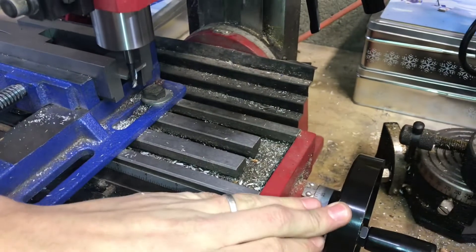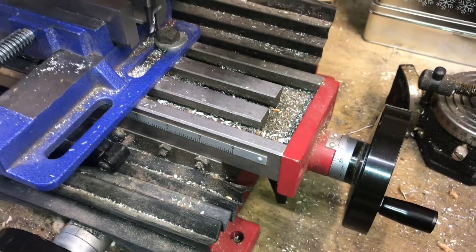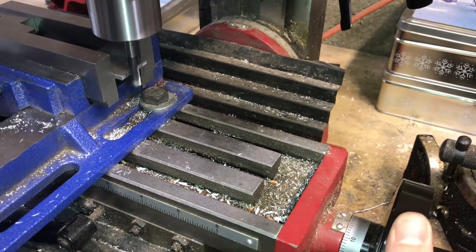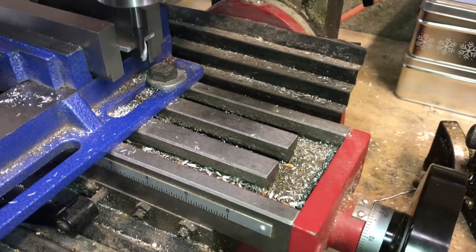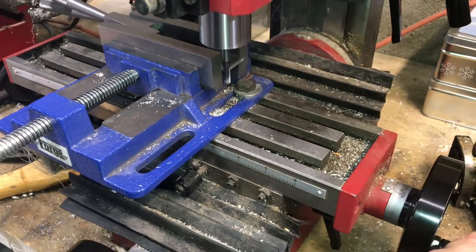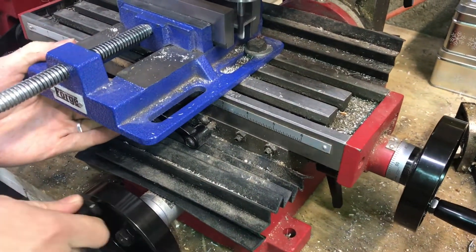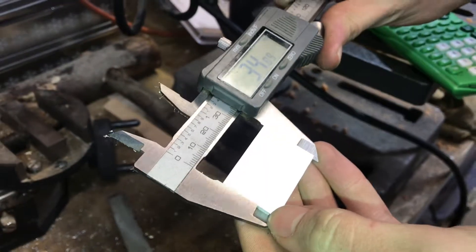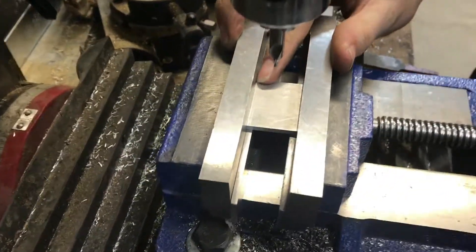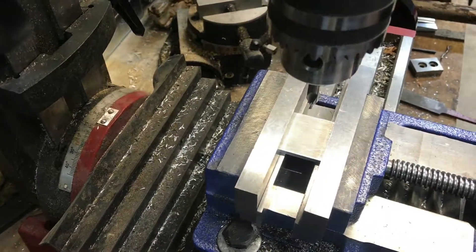I saw it take off material there. I can rotate this until that is at zero and I'm going to test that again to make sure. It looks like I touched at zero again, so I know that my face is zeroed off. I'm going to go ahead and take off 70 thousandths. We're about 0.1 millimeters off — that's good enough for what I'm doing. And on the other side we're good. And that is how you square a piece of flat stock on all four sides. You should get it pretty parallel and perpendicular and you'll be ready to do any other secondary operations like drilling or other milling and slotting. Thanks for watching.